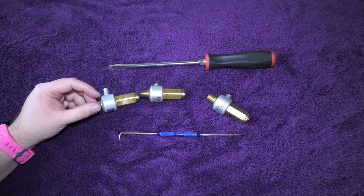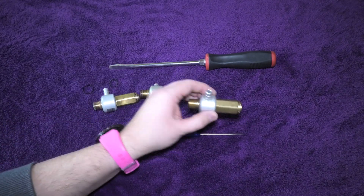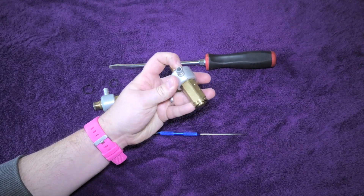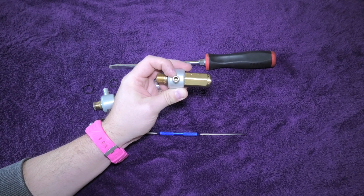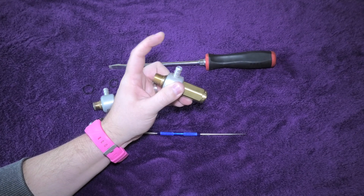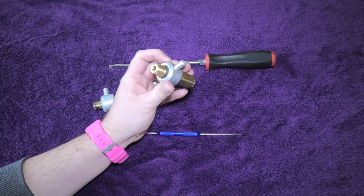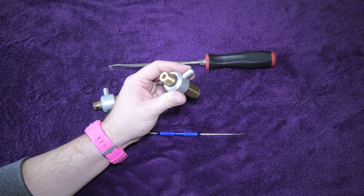So if there is excess pressure, the safety relief valve kicks in, and you have an output here which basically just goes to ground. Outside the van, or if you're using the machine outside, it will just waste away. You'll also find that if you're on and off the trigger, you'll get small dribbles of water coming out here as it releases the excess pressure.